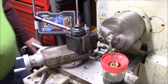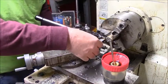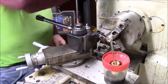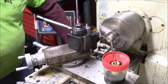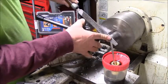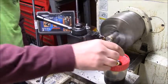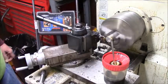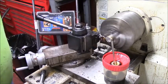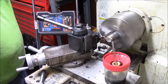So what I'm going to do here for your viewing pleasure is go ahead and get these machined out right quick, so that we'll have these ready. I'm going to mail the rest of them up to him and myself. Just for general information, normally when I do these tool studs, I just use 1/4 20. So that's what this is. It's basically a 1-inch bar. I'll machine off another section. We'll just slice it like bologna, like we've been doing.